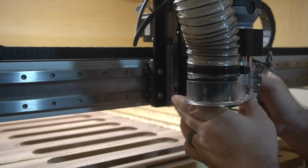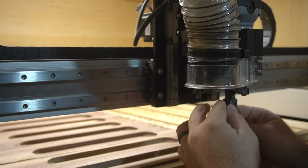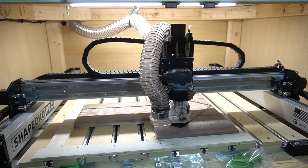You also need a set of end mills, also referred to as bits. I wasted a lot of money at the beginning when I was getting into CNC because I didn't know what bits I needed. So I would just buy bits and then I would use them or they weren't the right ones. So what I've learned is I narrow it down, just starting out, to these 3 bits. You start with a 1/4 inch upcut bit, a 60-degree V bit, and a bowl and tray bit. I do 75% of my work with those 3 bits. If you have a project in mind to do something specific, it may require different bits, but I recommend those 3 to get started because you're always gonna use them and there's a lot of versatility there.